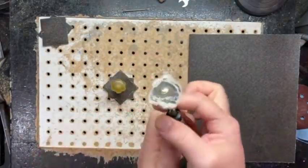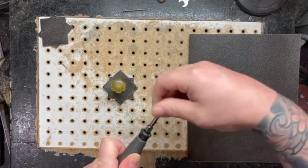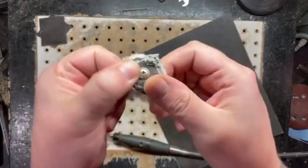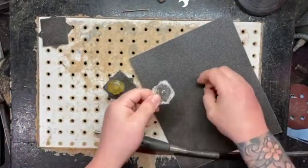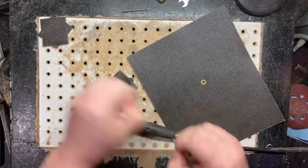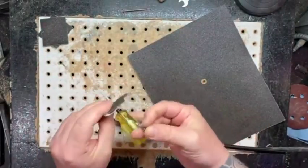Sometimes getting a hole in the sandpaper can be a bit of a task, but with the pokey it works perfect. Next, I hit the lock button on the flex shaft and I just unscrew it like that. There's the screw with the little washer. I push down, the old sandpaper comes loose, I pull out my little screw, toss that — then you've got your screw ready. Pull out the pokey.